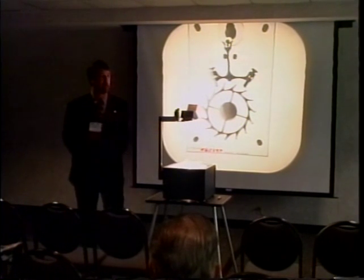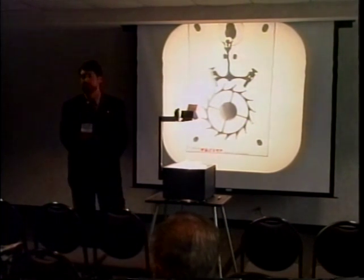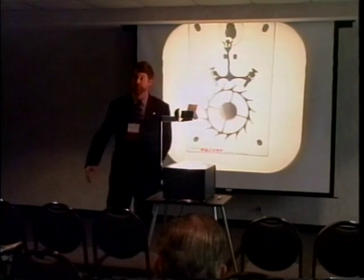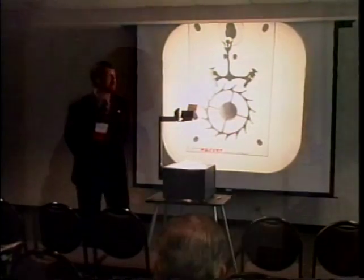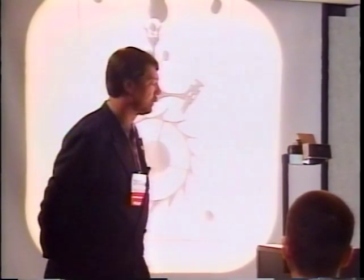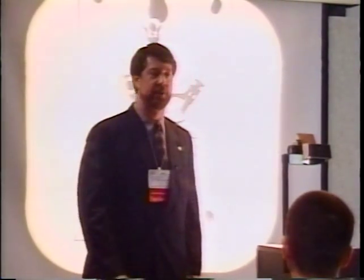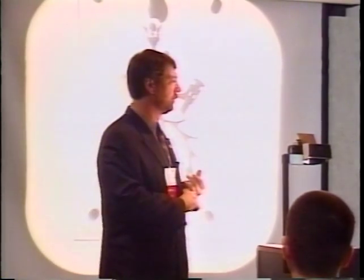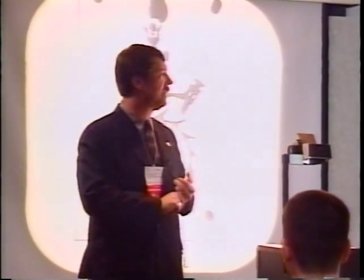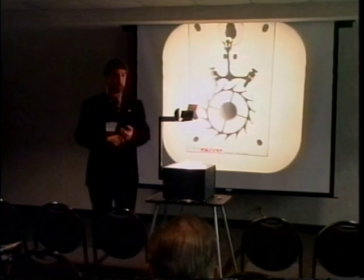It was unbelievable the things that I learned from drawing that escapement. But there were still some unanswered things that I didn't know. It wasn't really till I went to WOSTEP, when they simplified it so well, that I had the opportunity to pass this on to you guys. Even though the escapement is a situation that you don't see in all watches, you can develop some quick check ways to eliminate it from the possibility of being a problem. It might only be a 5 or 10% situation, but when you're trying to be efficient, making a living, you don't want to have to do the job a second time. And the more of those mystery comebacks that you can eliminate, the better off you're going to be.